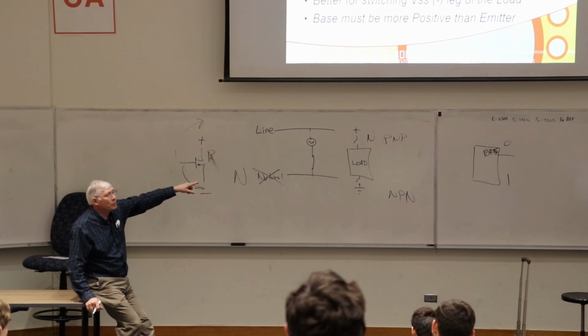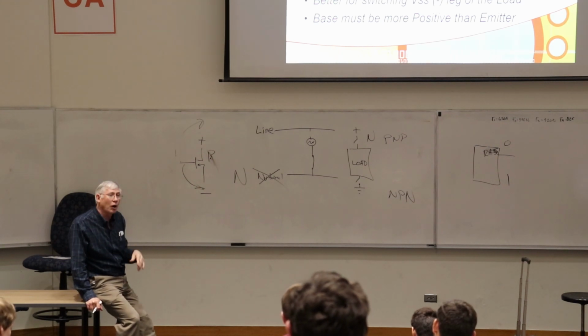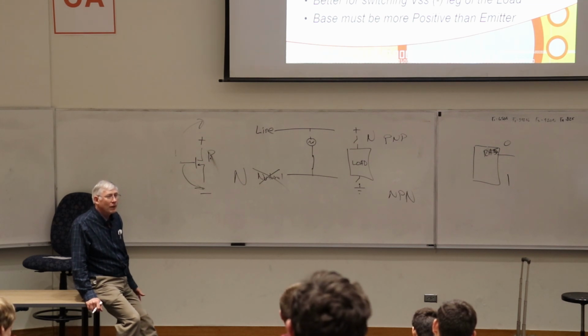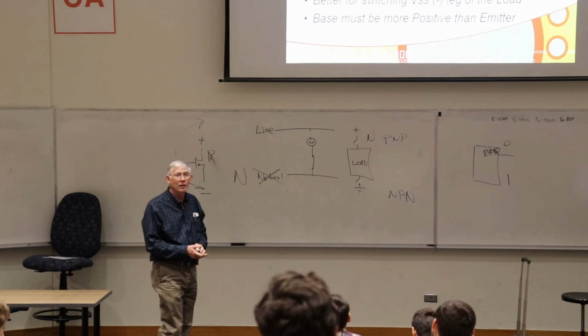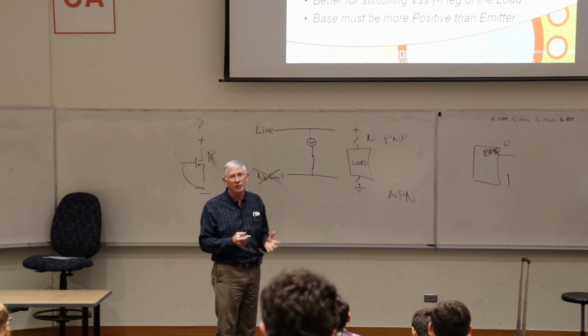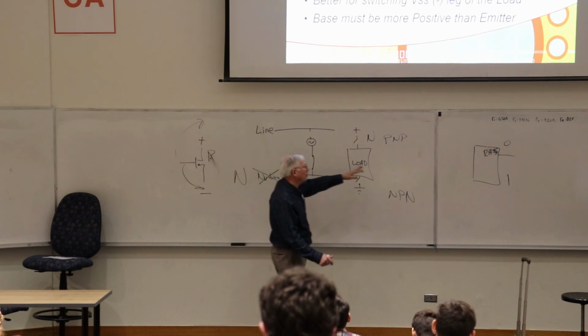So what's the difference? What do we use with really high power? Do we use FETs or BJTs? I think we use FETs. How many think we use FETs for high power? That's right, we do. Why do you think we do that? The material it's made out of, probably. It has to do with on-channel resistance, and it also has to do with BJTs, the way they're built.